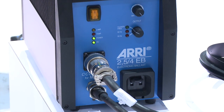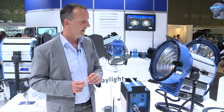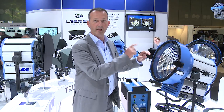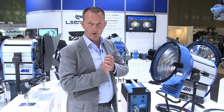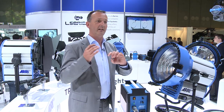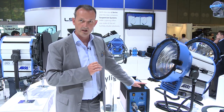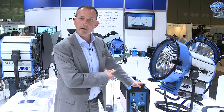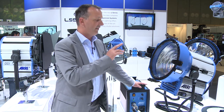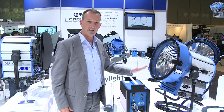There is a head-to-ballast cable that connects the lamp head to the ballast, and this cable can be elongated up to 100 meters. If you elongate this cable to 100 meters, you would have losses of 500 watts — meaning at the pins of your lamp head there would not be 4,000 watts, but just 3,500 watts, and the lamp head would lose brightness. This CCL ballast makes sure that all the time, no matter how long the extension cable is, there are always 4,000 watts at the light source.